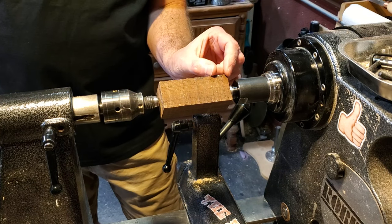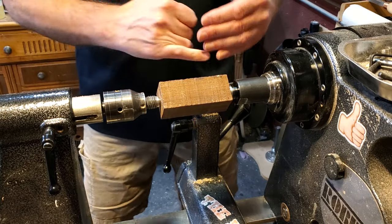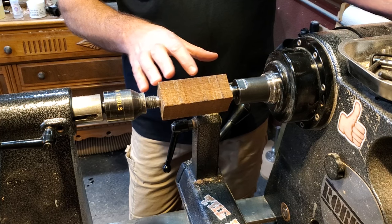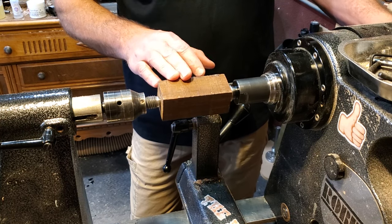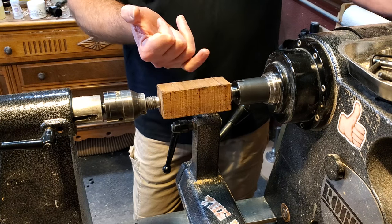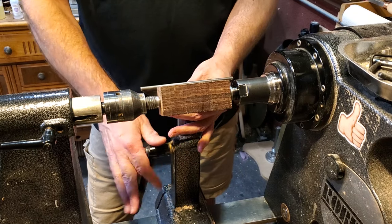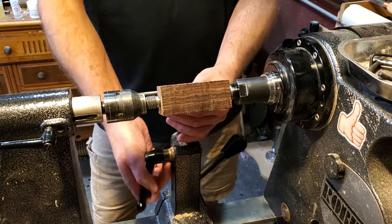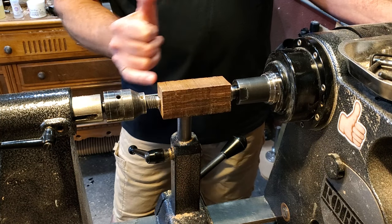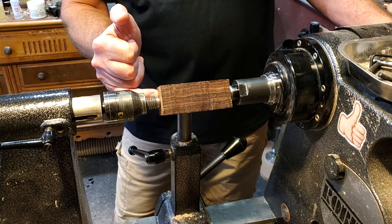The threads only go in there just a little ways, so supporting the tailstock as you're turning it is key to keeping any vibration down. If you get a catch or something, it could just break the piece of wood out. So make sure that you have that tailstock up and you turn 99% of the piece before you pull the tailstock away, and then all you have to do is clean up that little spot right there on the end